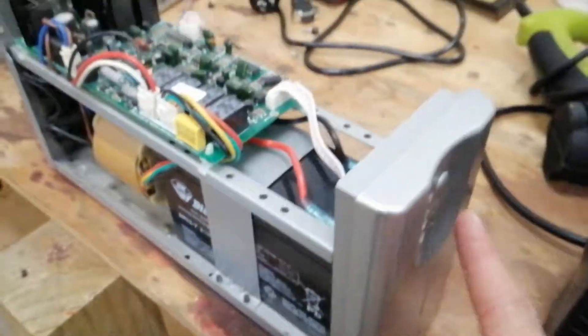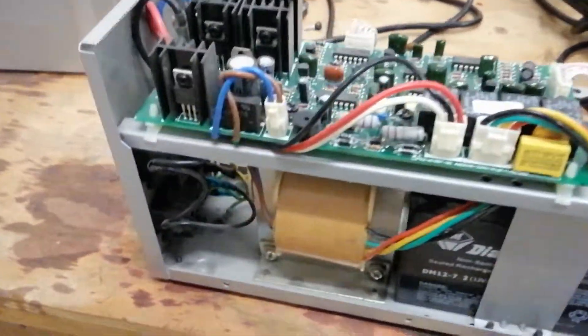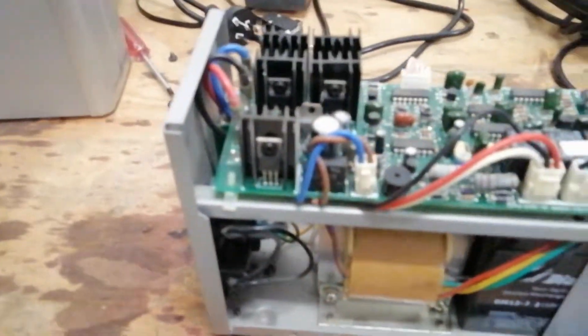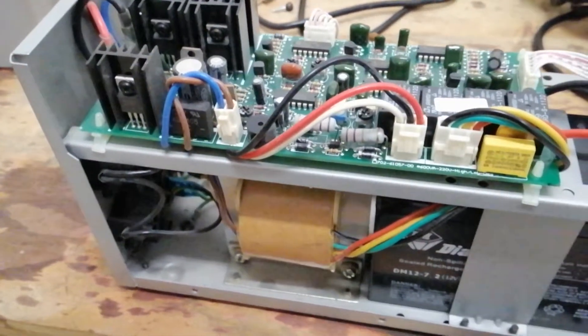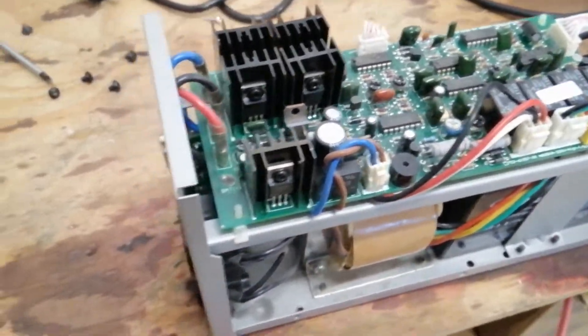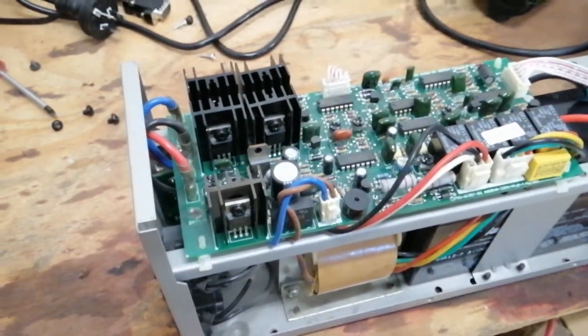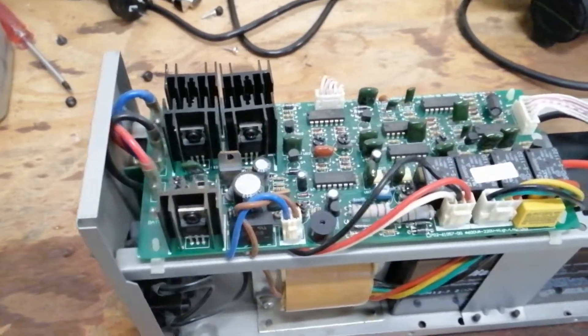You'll see it actually still works — it's very noisy though, you might be able to hear a slight hum. You can tell because of the hum that it is a modified sine wave inverter, meaning that the waveform on the output isn't sinusoidal. It is more jagged — it has square-type edges.